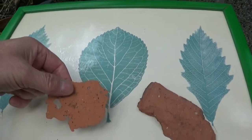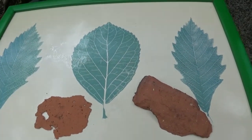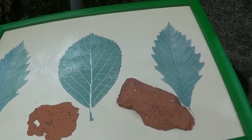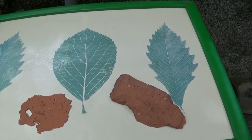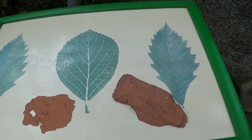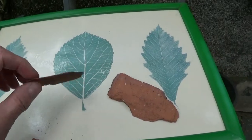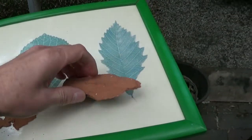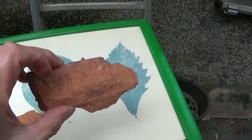You often see brickwork where it's scabbed off like this, and in extreme cases you can see where bricks have actually been hollowed out because once the fired face of the brick has been blown away, the substrate behind it is weaker still and more subject to wind erosion and such like.